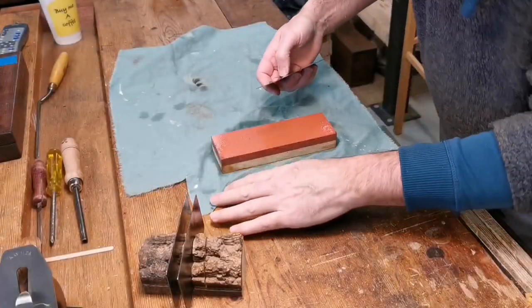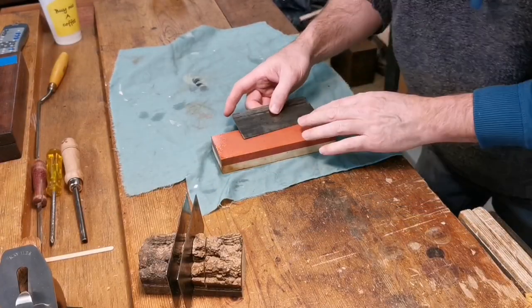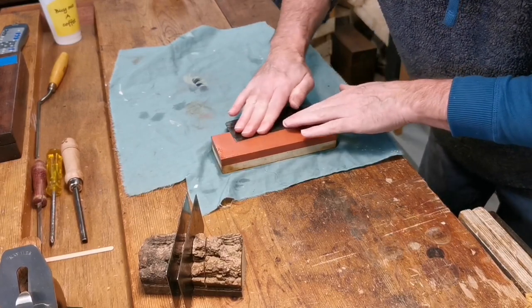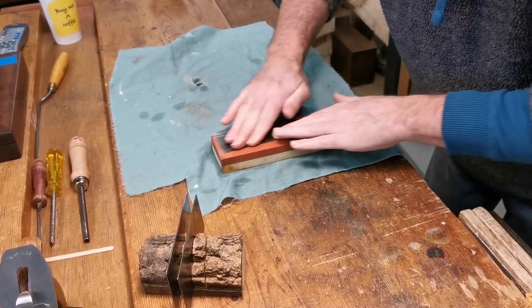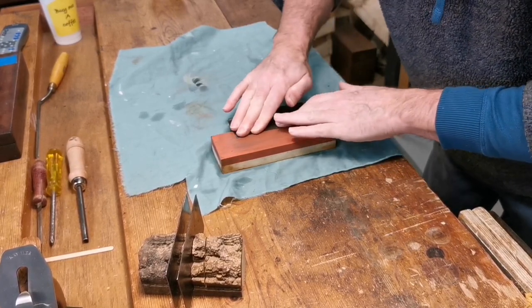If you're the sort of person that would buy this Acubur thing, I'm going to raise the game a bit. What I'm going to do is use one of my waterstones. This is one of those affordable water stones — it was like £7.37, a few quid. If you're going to spend the money and refine your method to give you a better edge, we might as well use a nicer stone as well. We're on the 3000 grit side. First of all I'm just going to flatten this off to take the burr that's already on there — and there is a good burr on there — so this is going to do a little bit of damage to the stone. I can live with that.